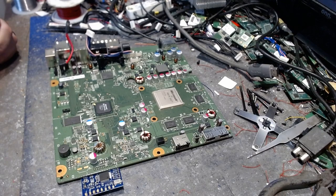We're going to be paying attention to E, C for your clock, B for your post out, A is going to be for your reset cable. Then, of course, you got your grounding, 3.3. E is going to be for your PLL, which is located under the board, of course, under the X clamp.